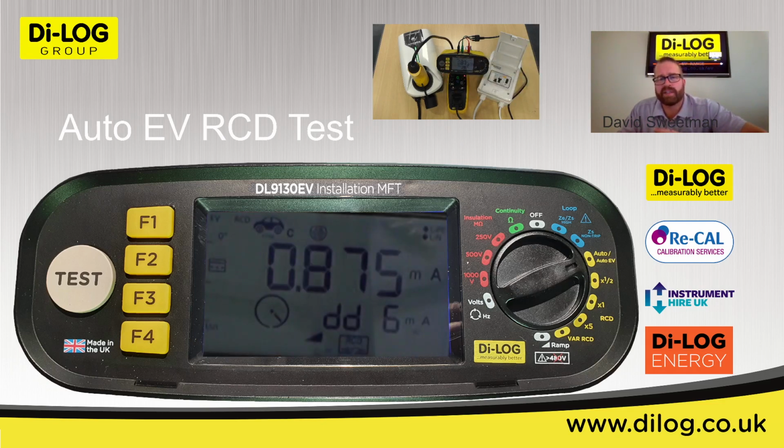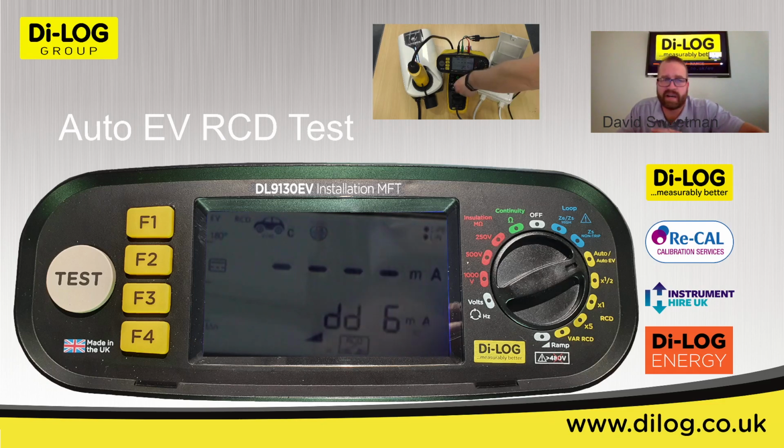So whilst we're at it, we're going to do a ramp test. And what I said at the very beginning of this is the test needed to be conducted over a 10-second period. So the protection within the EV charger needs to have at least 10 seconds to actually enable it to stop the charge on the EV charger as well. We've proved it already that it's well within that time, and now it's just checking the current that's tripping out. That was just about 4.46. I can't remember. It's well within its parameters.